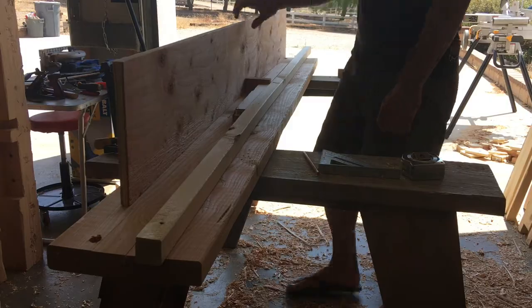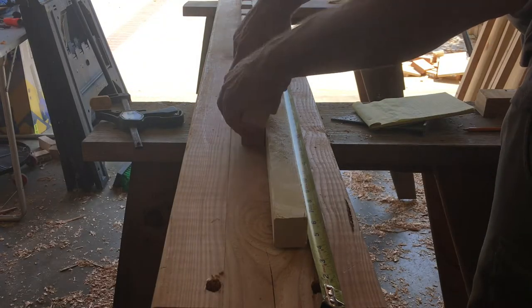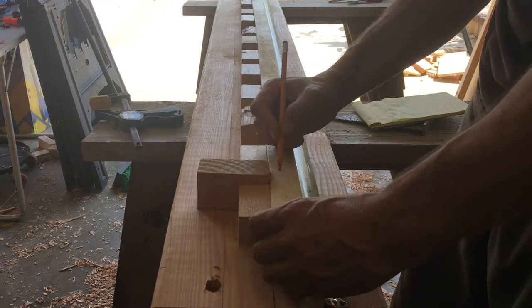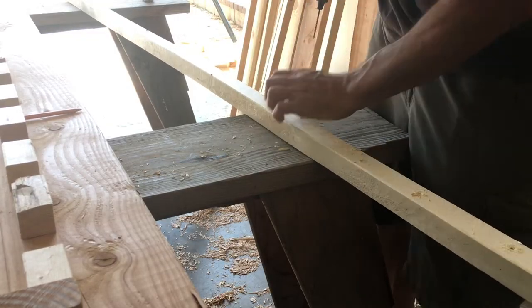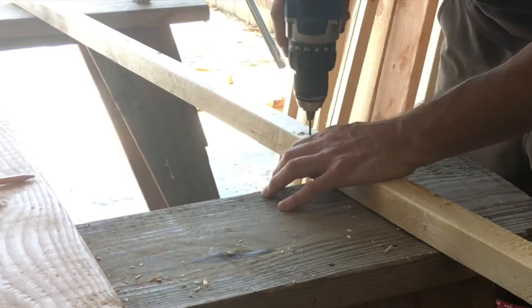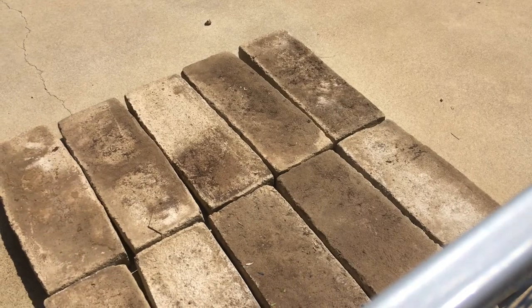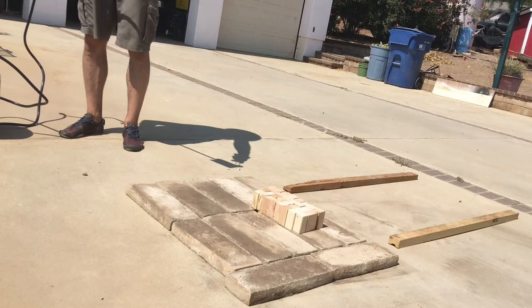That's just a fit cut for the big two by two rail that's going to support the two by fours and the plywood and everything. I was just getting it measured and making sure I had enough distance, because I wanted the mattress to sit down into the side rail by about an inch. These two by twos are just getting drilled to support - they support most of the weight of the bed, so it's important they get anchored in. And now comes the fun part - the Shou Sugi Ban burn.